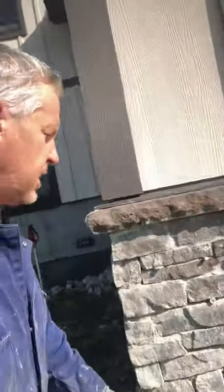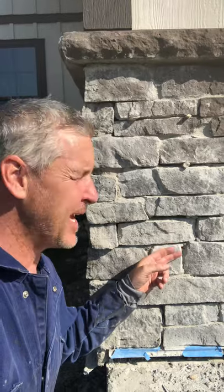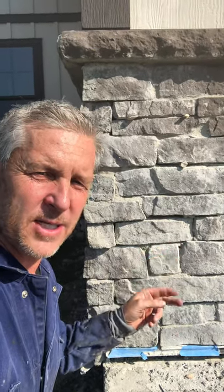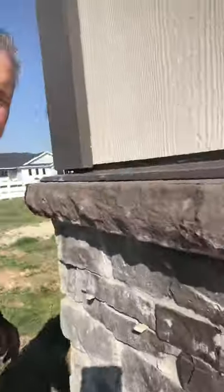So this is how to make cultured stone bricks yourself with our secret formula, which is 30 pounds of high strength concrete plus 1 pound of dye and 7 cups of water added. The mixture is 6 cups of water first, add 1 cup of dye, add the 30 pounds of cement mixed in 3 segments, then add the last cup of water, so 7 cups of water, and then mix it up and then put it in a mold and vibrate it to compaction. We hope this helps you make cultured stone, as you see here, with flat bricks, with corners, and top edges.